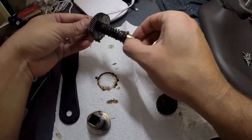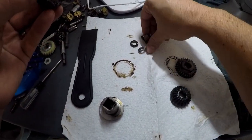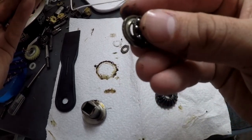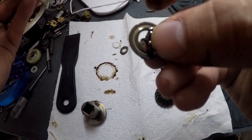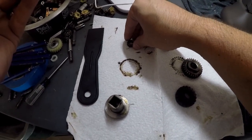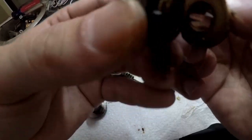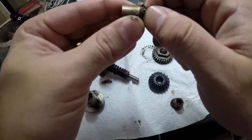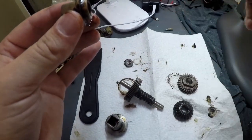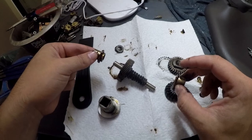When you get to the worm gear, you're going to see those little bearings I discussed. We're going to remove those. What you're going to find is there's going to be what they call the bearing sleeve — there's one on each end. Take note of the bearing that's actually in here — there's a bearing in the middle and then there are two washers. You see the little channel that runs in the outside one — they sit in that channel, and there's also a channel on this one, and those little balls just sit in the middle of that. Now take note of the back one — these are different sizes. The back one has a little bit of a lip on it where this one does not. The one that goes with the bearings goes on the front half of the gear, and the one with the extra little lip goes on the back. You don't want to mix those up, otherwise that gear is not going to sit in there properly.